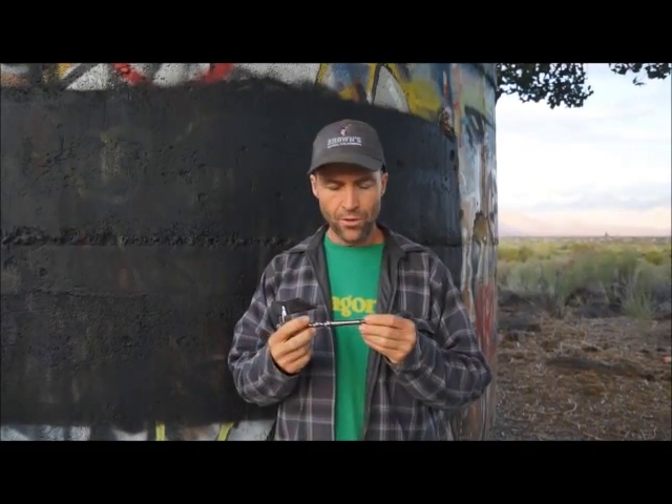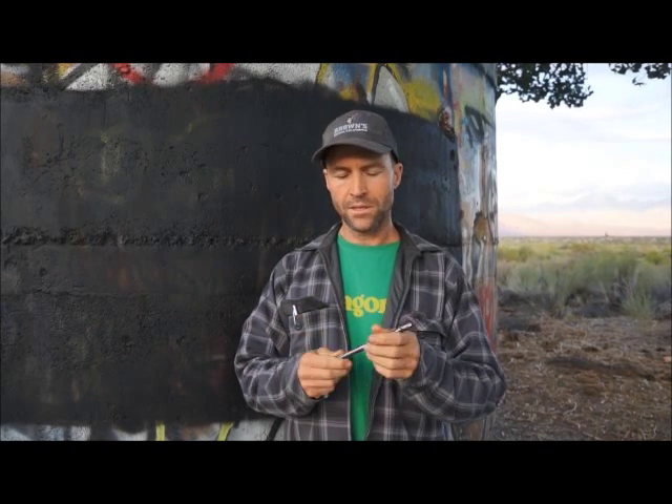Let's go ahead and talk about placing this bolt. The first thing we need to do is drill a hole. The standard bits we use for a power drill or a hand drill are carbide-tipped, usually an SDS bit. The length of the bit penetrating the rock or concrete needs to be longer than the length of your bolt. Six inches is a pretty standard length bit and it seems to do the job well. I normally drill the holes at least a half inch to three-quarters of an inch longer than the bolt so you can remove the bolt. A piece of tape on your bit works well and gives you a mark for how deep you need to go.